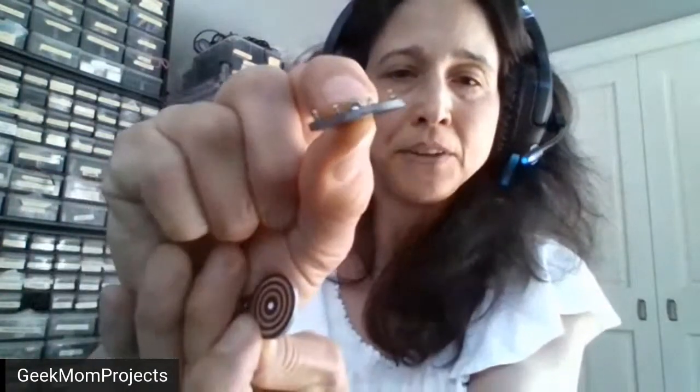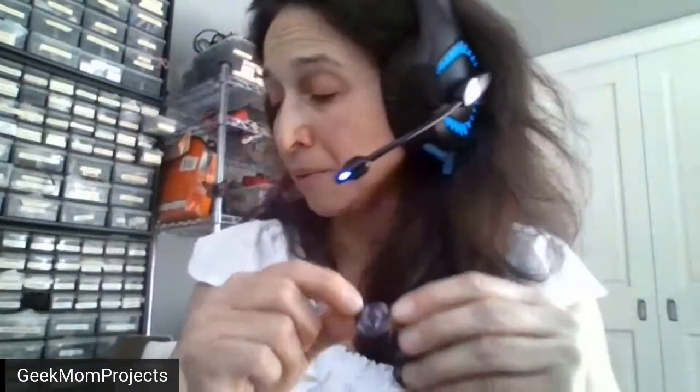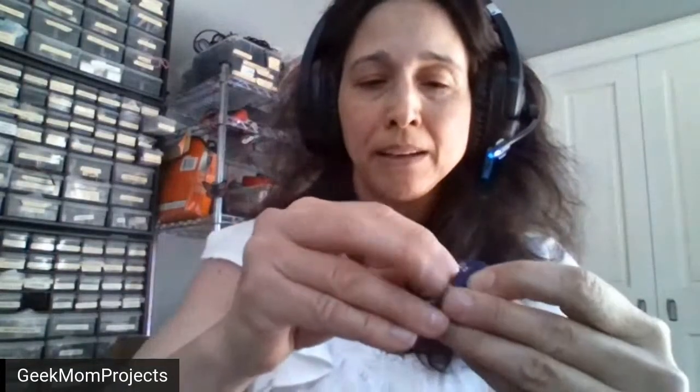And the bottom layer, which passes a signal to the next board, has these little pressure contacts. And I've got a laser cut layer in the middle to stop it from squishing the contact pads down too much. So each segment goes on top of the previous one, and you connect the two with a plastic rivet, and so they can rotate relative to each other. Each segment of the chain is one top layer connected to a bottom layer like this, and then you can connect them to the next link in the chain with little rivets that connect the contact to the LED, the top layer LED PCB.